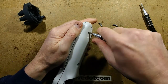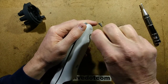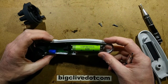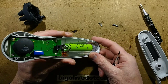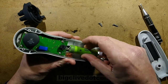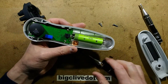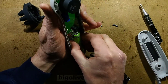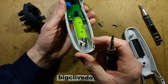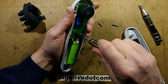It's an interesting implementation - the fact that they've got rid of the mains reference, because the standard violet wands are just a bit vicious electrically. That's a big cell - standard 18650. They've got copper tape onto the back metallization in here, which is the hand electrode. This battery is also held in by this foam pad. It's not an internally protected cell, but that's okay - it will have protection circuitry on the board. Let's get the board out.